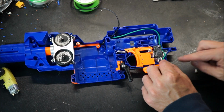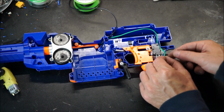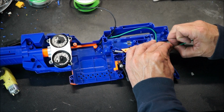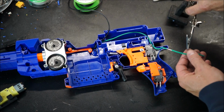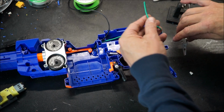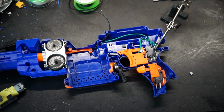Okay, cool. So right in here, and the great thing about silicone insulated wire is that typically speaking, you can take it and just peel it. If you pinch it, you can open it up just like I did right there. So we're going to take our handy hands and hold it still because we're going to tin it up. So there we go, that's fine for that.